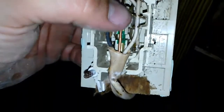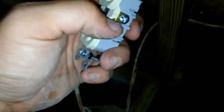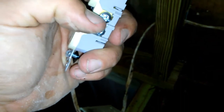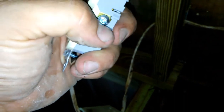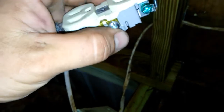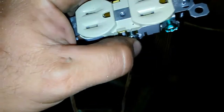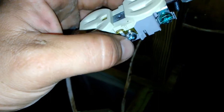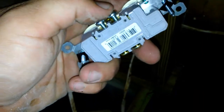I can't say I've ever seen this same problem with standard outlets, because if you wrap your wire around the screw and torque it down good, the whole wire might be corroded around it, but as soon as you take the connection off you'll see a round clean patch of copper. The screw bites down and seals out the oxygen from that small part of the copper wire, so you don't get corrosion there.